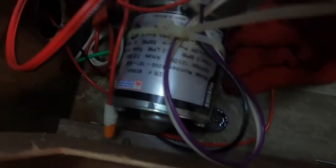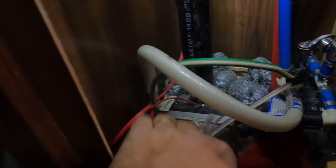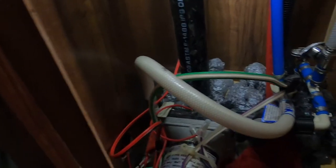I had a little water leak because I forgot to cut the city water off, but it's off now. The lines are drained and this is ready to come out. There are four screws on the bottom here, just behind the rubber feet. Two lines, two power lines. So you disconnect this line here and this line here from the pump, do the four screws, pull it out, and then I'll show you the new one to put back in.